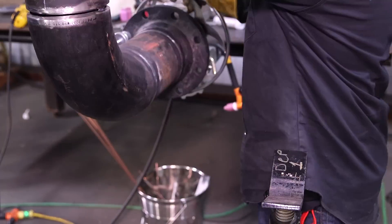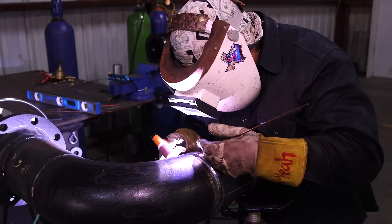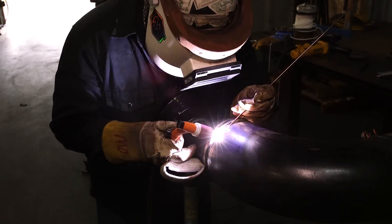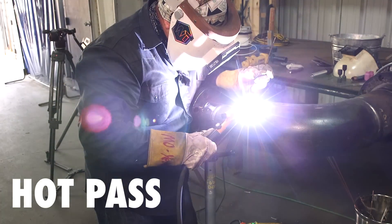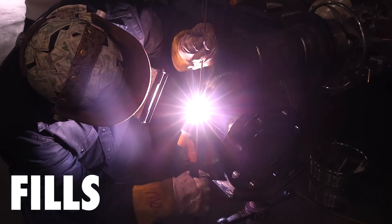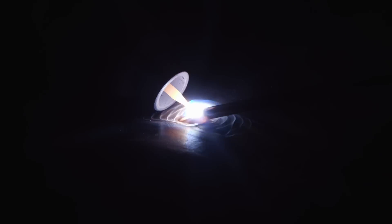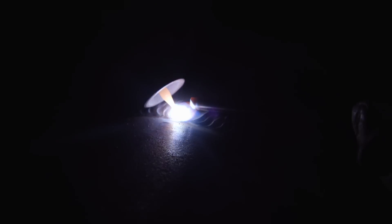We're going to fit up this last roll, the six inch. Just keep going side to side, small steps — whatever you feel comfortable with. I like to freehand my roots. Now I'm going to flop it this way, do the jack stands, do the other side of the root. Slide my cup side to side, hitting those walls. Right now I'm burning at 200 amps and I'm using 5/32 filler wire. If you're not burning hot enough or you're taking too big of steps, do those smaller steps, fix that wire. Make sure you're fusing in really good, feeding some wire. You could get a nice fusion.